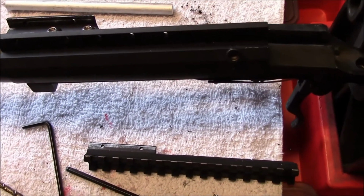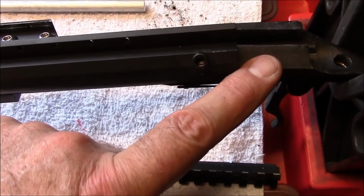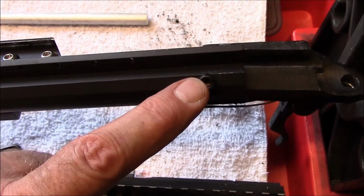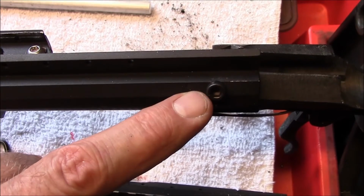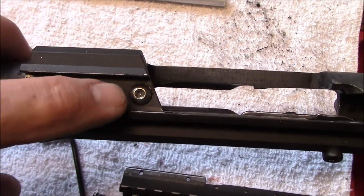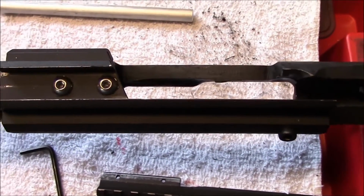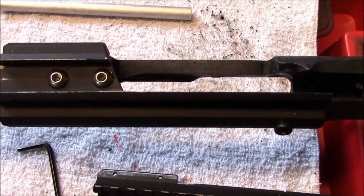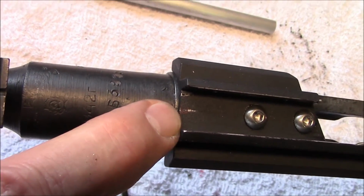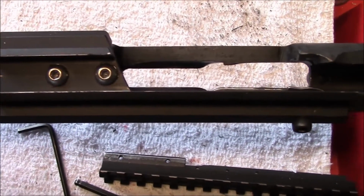Okay, I drilled the 3/16 hole through the mount only, not into the receiver. You're going to take out the threads there. That's clearance for the thread on this 10-32 by 1/2 inch long socket head cap screw. That's installed. The two main top screws are installed, all after cleaning the threads and using Loctite 262, snug down real tight. And you remember why we have a little step here, because I wanted to verify the centering process.